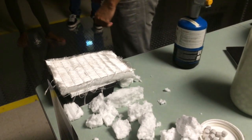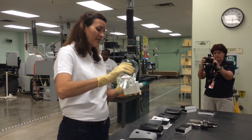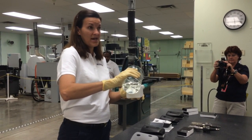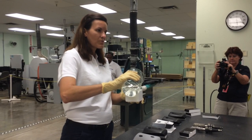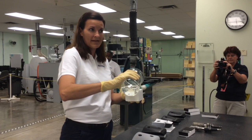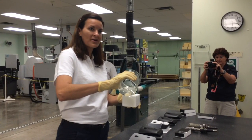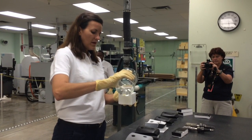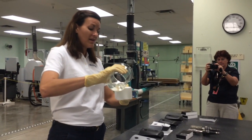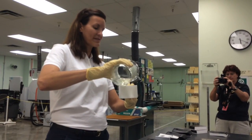This oven here is running. The tile can absorb about 700% of its own weight in water — so if you have a one-pound tile and it gets wet, you've got a seven-pound tile. Most of our vehicles, when they go out to a launch pad, don't just roll out and fly the next day. They can sit out in the elements, in rain, in hurricanes, for up to a month. So you don't want water soaking into your tiles or you'll never get your vehicle off the ground. So while we're fabricating the tiles, we impregnate them with a waterproofing agent.